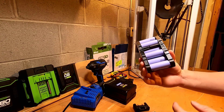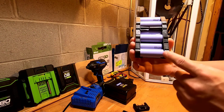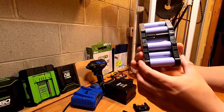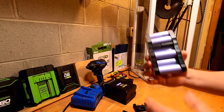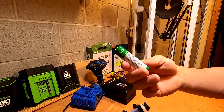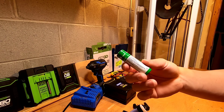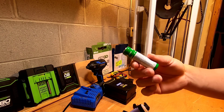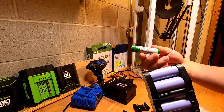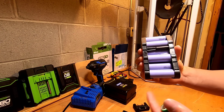So this is a 24V 4Ah power pack, which means it's six cells linked together in series. Each cell is 4Ah. So you can see this is a big cell and it's only 4Ah. When you look online for battery cells on eBay, there are 18650 battery cells listed at 4Ah or 5Ah very commonly. But you can clearly see there's no way to make this small a cell into 4Ah or 5Ah — otherwise they wouldn't need to use this kind of big cell to make 4Ah.